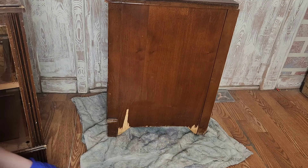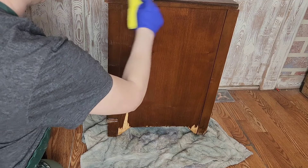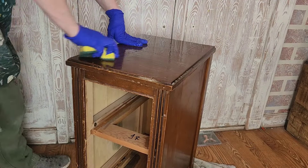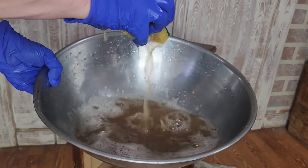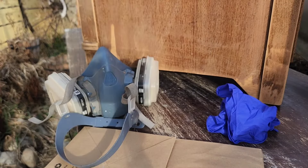It is a very concentrated powder — you mix one tablespoon to eight cups of water. What I like to do is add it in a spray bottle, spray it on, give it a good scrub, and then wash that off with water. This piece was straight up filthy, but it also had a lot of failed veneer.